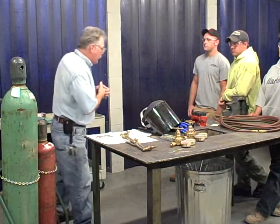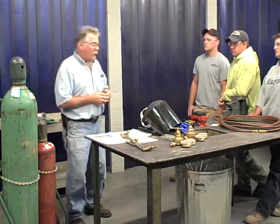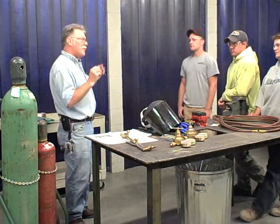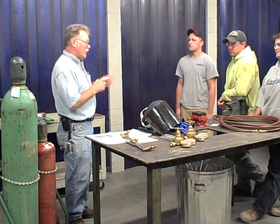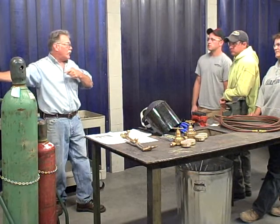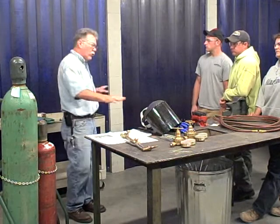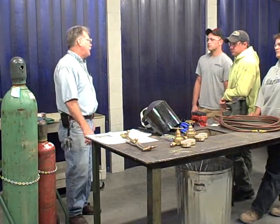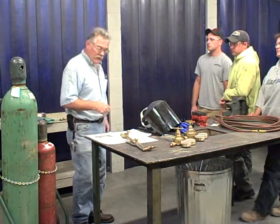So let's start with some of the first things you want to do if you're working with the oxyacetylene torch system. If you remember as we talked about in classroom, what's one of the first things you want to identify? We're thinking about fire. Inspect all your fuel lines. We're going to do that. One of the first things you want to do is identify your fire extinguisher. You know where your fire extinguisher is. And check some housekeeping. Get a quick look around. Make sure there's not a lot of paper or fire hazards laying around. So one of the first things you want to do is locate the fire extinguisher and inspect your work area for fire hazards.